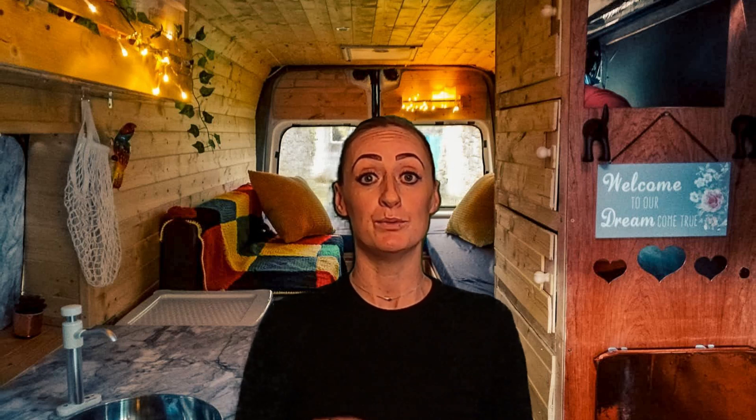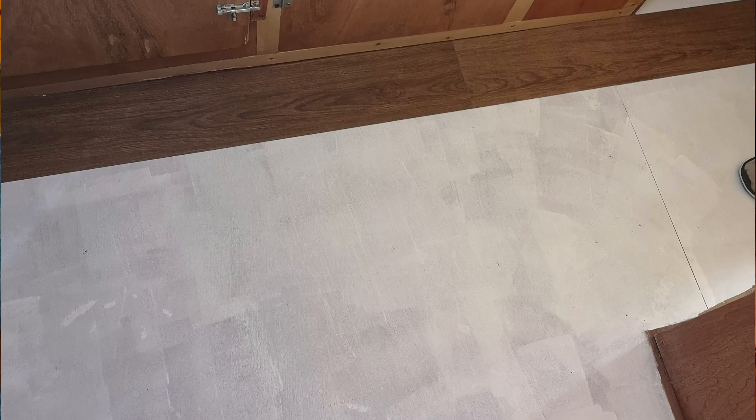We did have a little bit of an issue when we applied our flooring, as we applied it in the height of summer. It was a very hot day — we knew the wood would probably expand more — but now when it's cold you do see a tiny little crack in between the planks. It's very small and minimal so you may not even notice it; we really don't care. The base of our floor is 18mm plywood. On top of this we use a water resistant primer, which helps to protect the plywood floor and acts as a great base for the adhesive vinyl planks.